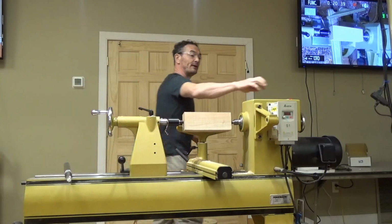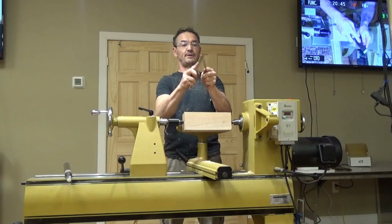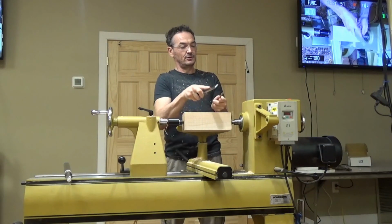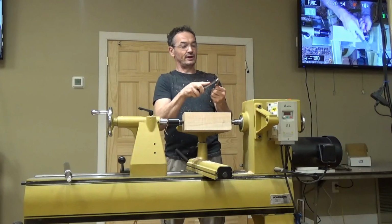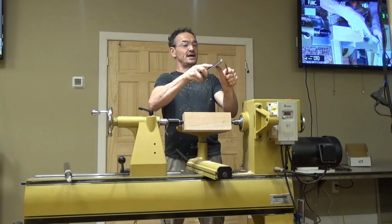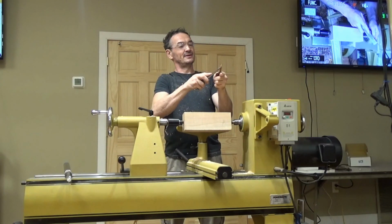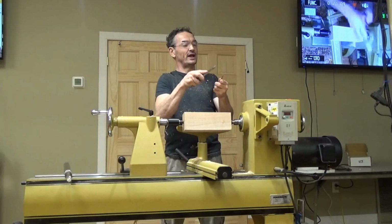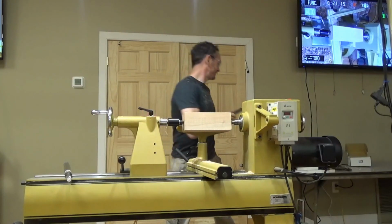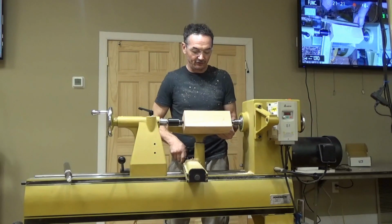It's really simple. This pencil, it's a skew chisel. When the bevel's in contact, I can sharpen this pencil really easy one-handed. Beautiful cut, no tear-out, no effort. Watch what happens when I take the bevel off. It doesn't move. I have to push it with my left. Now it's damaging the pencil. You can hear it. It's scraping. That's scraping. That's slicing. The slicing is done one-handed. I don't need two hands to slice. So I don't need two hands to turn wood. What my left hand is doing, it isn't controlling the tool, it's just stabilizing it.